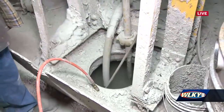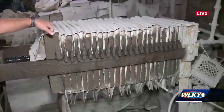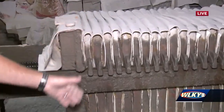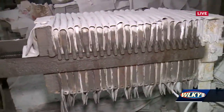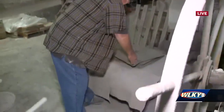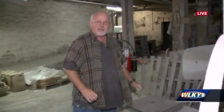The water's on top today because we're just now starting this morning. Once from there, we'll pump it over to what we call a filter press. It'll go in here at 200 pounds of pressure. All the little clay particles will stick to the cloth bags where the water will be squeezed out, go into a cistern here, and we'll recycle that water back over. The goal end result is to get a cake of clay — there'll be a slab or a cake of clay between each one of them, onto those cloth bags. So that's clean clay — we can work with that.